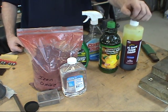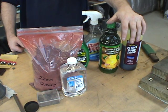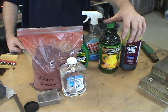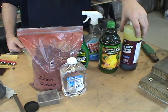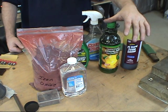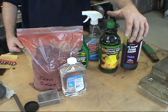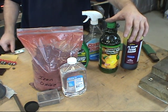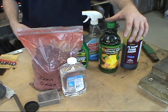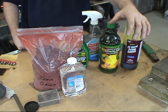Your blade is going to turn black when you're dipping it in the acid — it's going to have oxidation on it. It will oxidize on the hard steel, which I find very peculiar because the etching only affects the hardened steel. It doesn't really affect the soft steel as much. Through my personal experience, I have never seen the ferric chloride etch the soft steel — it only goes after the hardened steel.